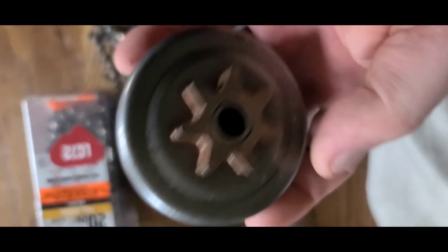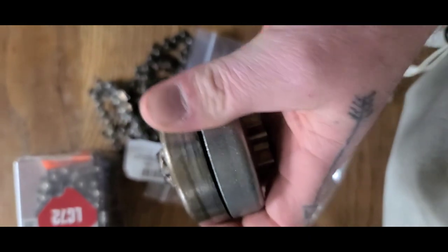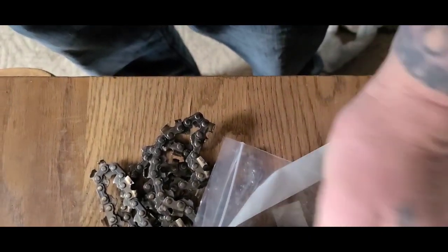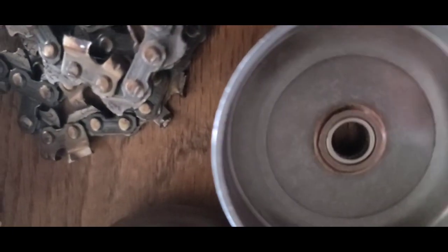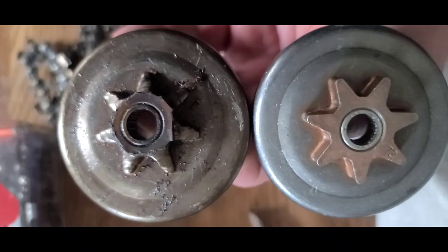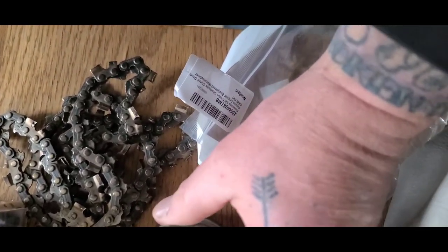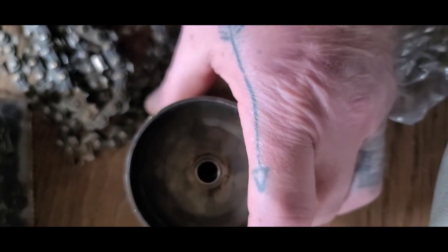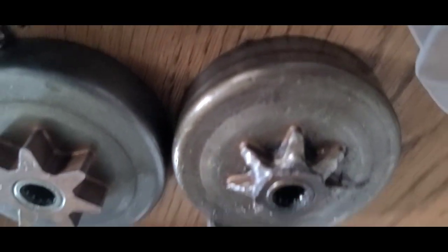I got the new part — exactly like the old part, same size, diameter, height. This one is a little higher but it's swelled. And that's worn down that much. The diameter of the bearings are exactly the same too. I look down in here — that diameter is the same down in there too. So, same part, it's just rolled down that much. Yikes.